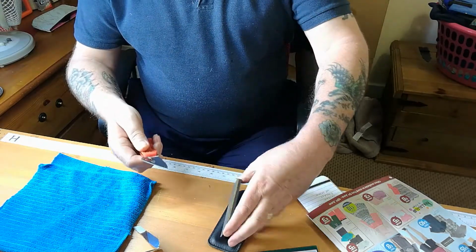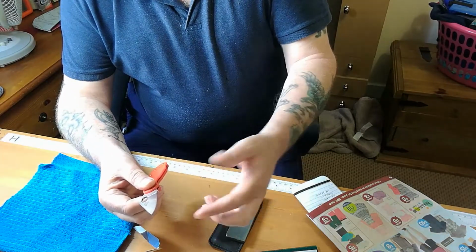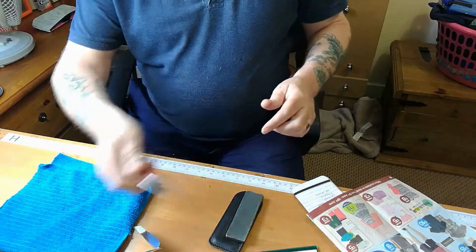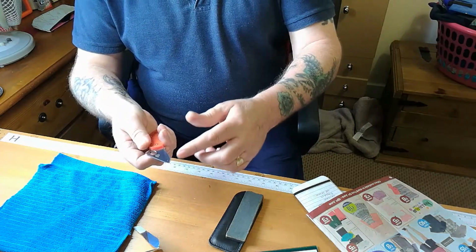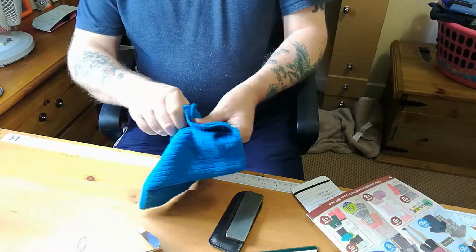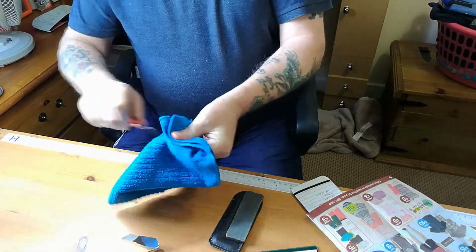Where you sharpen both sides of a knife, there's a wee, I can't remember what the proper name is, but a wee burr of metal comes up on the centre, because you're moving the metal as you're doing it, and it's like a wee hairline. That's all it is, just a hairline across the end of your knife, and that can stop the knife performing to its best. So hopefully you'll see now this should slide through the paper much easier.